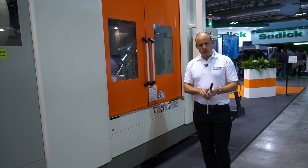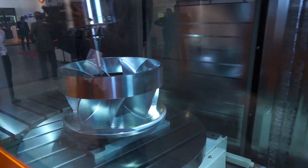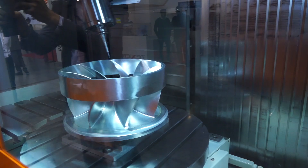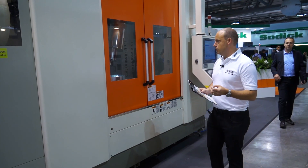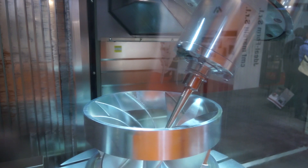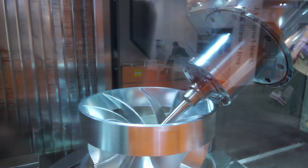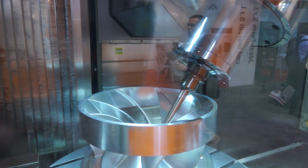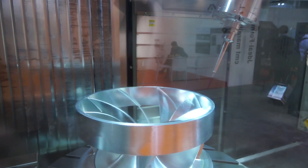You've got a 15,000 RPM spindle, so as mentioned, it's very fast, and it's got a BBT40 spindle face and taper spindle to give you maximum stability when you're machining. So the capacity of this machine — it's got an 800mm C-axis, and you can see from the dimension of that, the part visible here certainly emphasises the capacity of the machine.